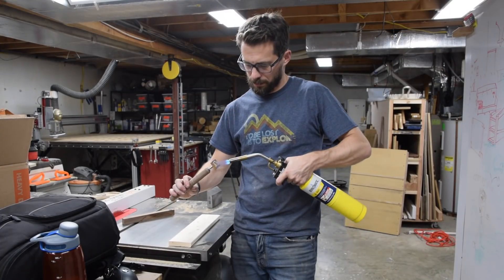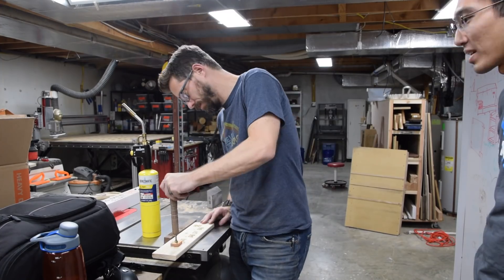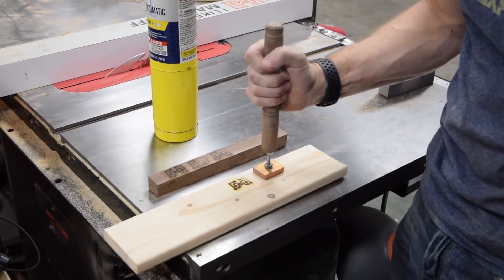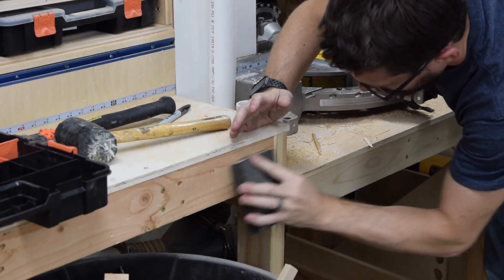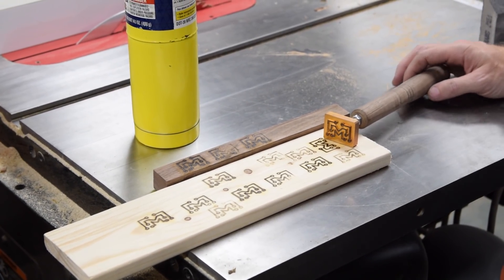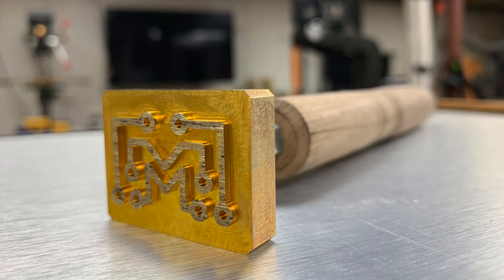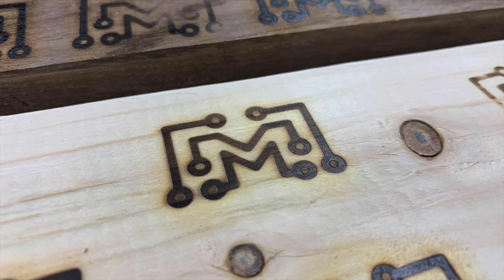To heat up the iron as efficiently as possible, we used a MAP gas torch. You'll notice a subtle color transition as the brass gets up to temperature. Then it's just a matter of applying steady pressure to the iron without moving it from the initial contact point. The results were great, though ideally you'd have a couple more inches of standoff distance between the iron head and the handle. This was just a quick prototype knocked out in an evening, and this is the basic version of how you can make your own branding iron on a desktop CNC machine. Thanks for watching, and thank Bob for being such a gracious host — I'll be back with more CNC projects from my cross-country road trip soon.